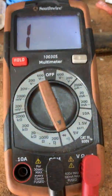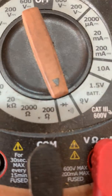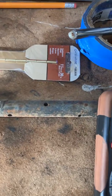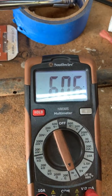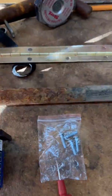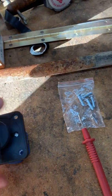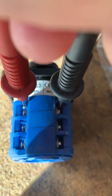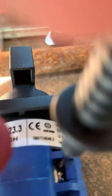If you're confused about how that works, you can use a multimeter set to continuity — put your two probes together and listen for the tone. To test the selector switch: right now there is no continuity between the first two tabs. As soon as I go to the first switch position, you can hear a tone from the multimeter. Back to off — no tone. Back to first switch — tone. Back to off.